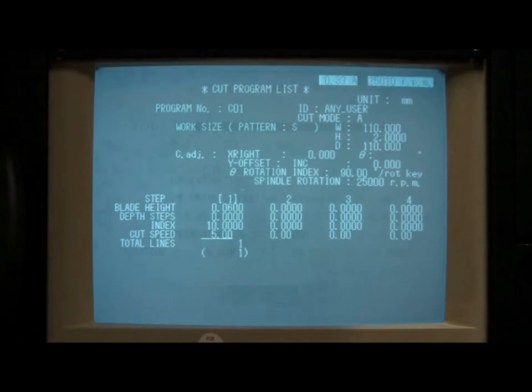The cut speed is the horizontal or x-axis speed that the substrate will travel at during dicing. You should read the appendix at the end of the SOP to select a proper cut speed for your particular dicing application. Silicon is most often diced at a cut speed of 4 or 5 mm per second. The final parameter you will need to program is the total lines parameter, which is the total number of cut lines you wish to make once you run your cut program. It is highly recommended that you perform a test cut before executing an entire array of cuts across your substrate. If you do plan to make a test cut, then you should set this parameter to 1 for now, as you can always change it later after a test cut has been performed.